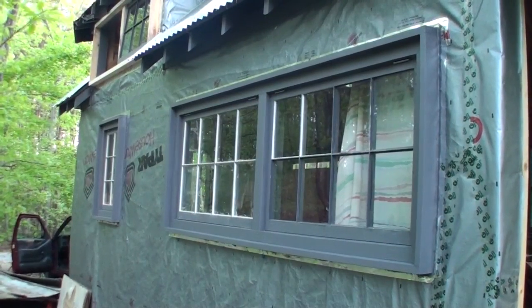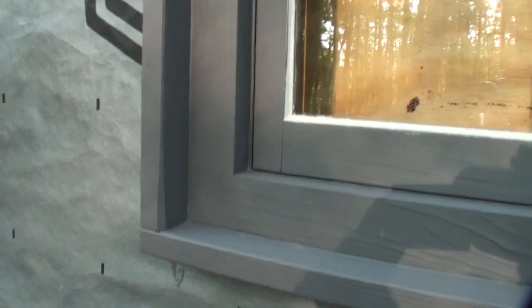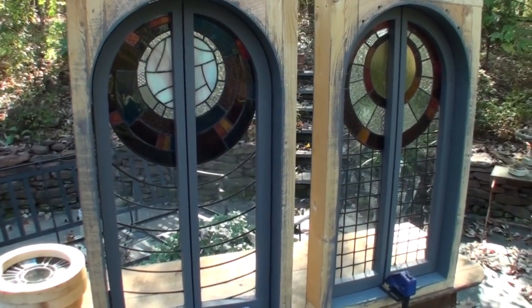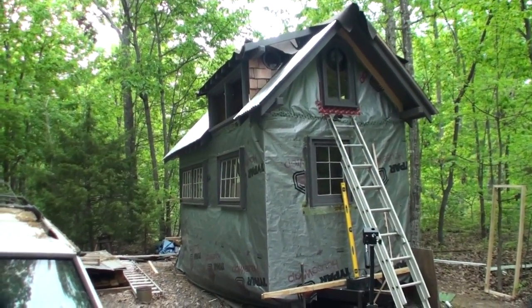Here's a closer look at the trim on the rest of the house, and it was a simple picture frame style with a 2-inch inner part and then a 1-inch thick outer band that stuck off 2.5 inches. If you'd like to see a video on that trim work, you can check that out on my channel. Those windows were the stained glass windows I'll be trimming out in this video.